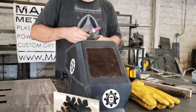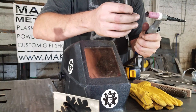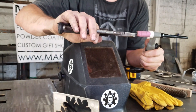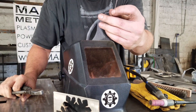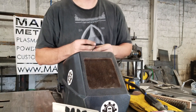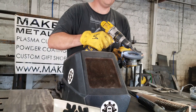At the table right now we're going to get an arc. I'm going to unscrew this guy right here, which will release the tungsten. You don't want to touch and grab this electrode — it can be super hot. So you just always want to use pliers so you don't mess yourself up. You loosen this guy up at the back, then you can pull your tungsten out. I've already got one side sharpened up, but this side I was practicing and touching the metal. Here's the trick for sharpening your tungsten on the cheap: you load it up into your drill, turn it on, and run it against the grinder. Nice sharp tungsten.